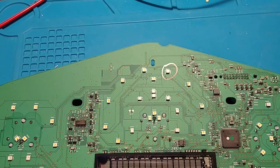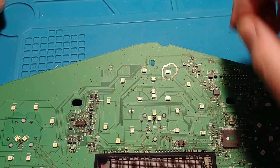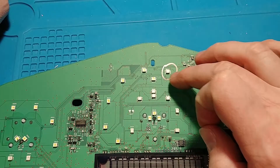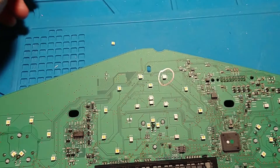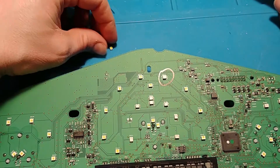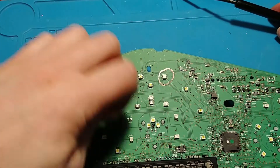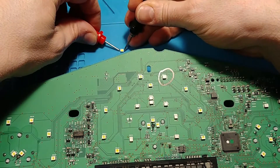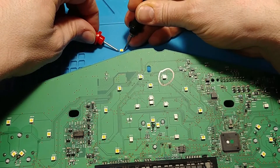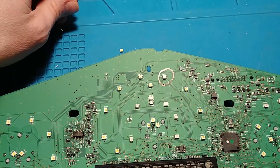It's just this one that is being our troublemaker. Like I said earlier, they use a bit of an odd package with the four pins. I don't have any direct replacement four-pin LEDs, but I do have a generic 3528 that's the same color and same power usage — this would be a good match.